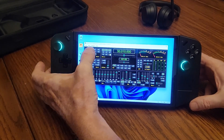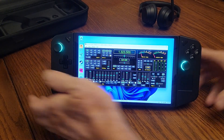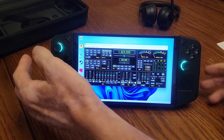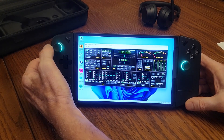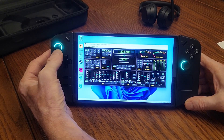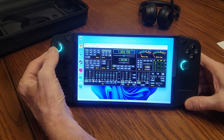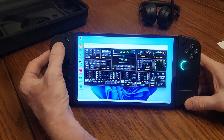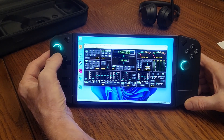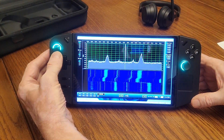I'll put it back to USB and go back to 160 meters, because there's not much else on the air at the moment. With the left joystick, I can move it to select a particular digit for tuning. The up and down will actually do the tuning. You can go over and pick the digits you want, and away we go. If you look on the spectrum, you can see it moving along as well.